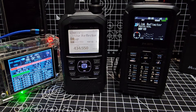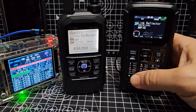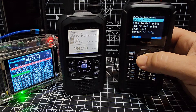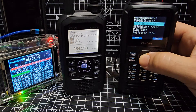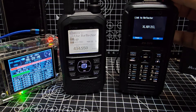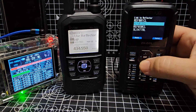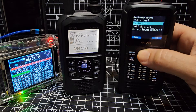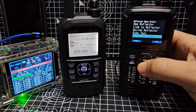The reason they've done DR mode, as far as I can see, is because it packages everything — it packages all the repeaters together and all the reflector numbers in one place. So when we're in DR mode, if we hold the arrow up to reflector, we can do these commands: use reflector is CQ-CQ basically, link to reflector — when you select that you can choose one you've been to before or click input and manually type reflector XLX, XRF, and DCS — which is very cool, a lot of functionality. Then you key and it will link you. Or you can hold up and unlink, do an echo test, or reflector info which will announce what you're connected to.